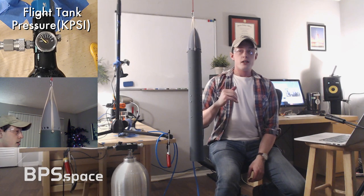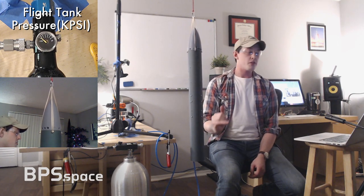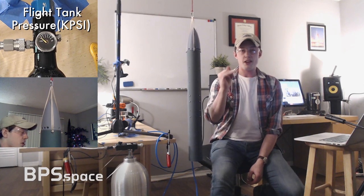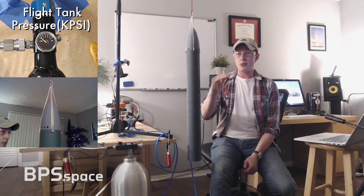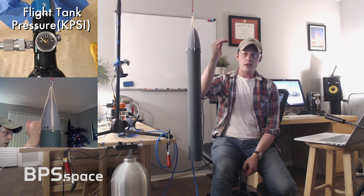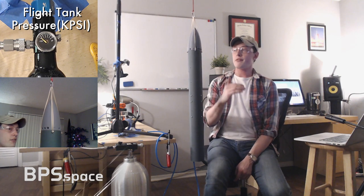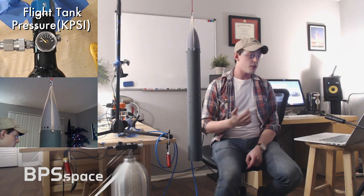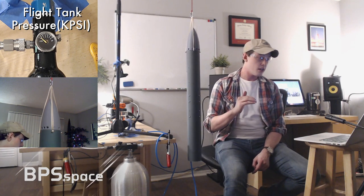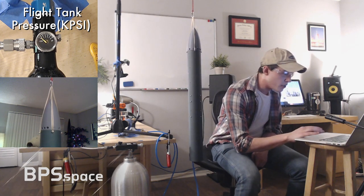And then there's a saturation limit. It's like a high pass filter, but it's not about frequency, it's about the value of the number that is the output from the PID. If the PID output is greater than 1, or I think in this case it may be 0.25 or something like that, if that value is greater than the limit, then it fires the thruster. So this is truly a straight bang-bang controller. Okay, what else? Let's get some more questions here.